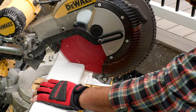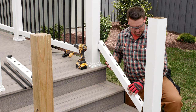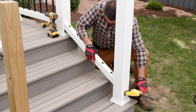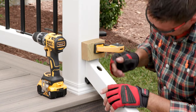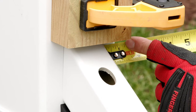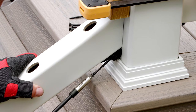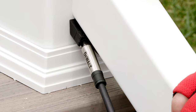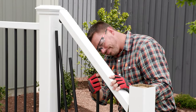With our rails cut to length, brackets installed, and bottom post sleeve cut to length, it's time to connect our rails to the posts. Set the bottom rail in place so that it aligns with the mark made earlier on the bottom post. Place a clamp below the rail bracket on the lower post, and place a clamp and a scrap piece of 2x4 above the rail at the upper post — the rail should align with the mark made previously on the upper post. These keep the rail at the correct height while we're securing the rails to the post sleeves. Next, center the bottom rail on the post sleeve. Because the screws will be going in at an angle, I find pre-drilling with an eighth inch bit helpful. To prevent the drill chuck from marring the sides of the rails, I use a driver extension for pre-drilling as well as installing the provided 3-inch wood screws. Insert all the balusters into the bottom rail, then lower the top rail down onto the balusters. I find that lifting and rotating the balusters up into the top rail helps speed the process.